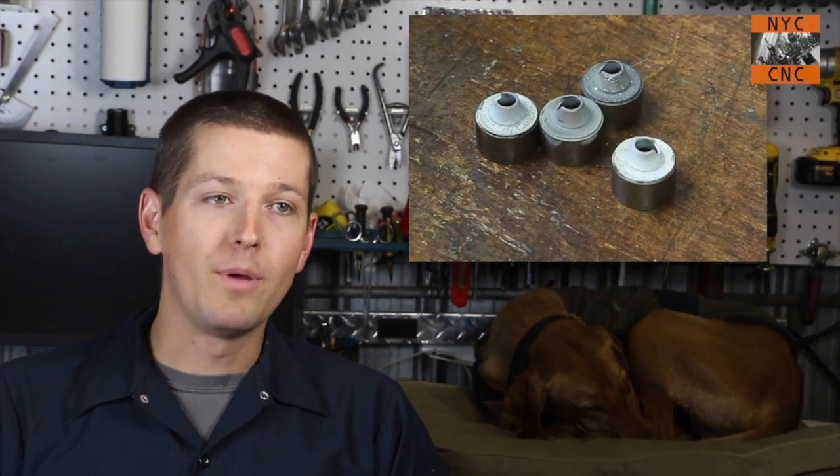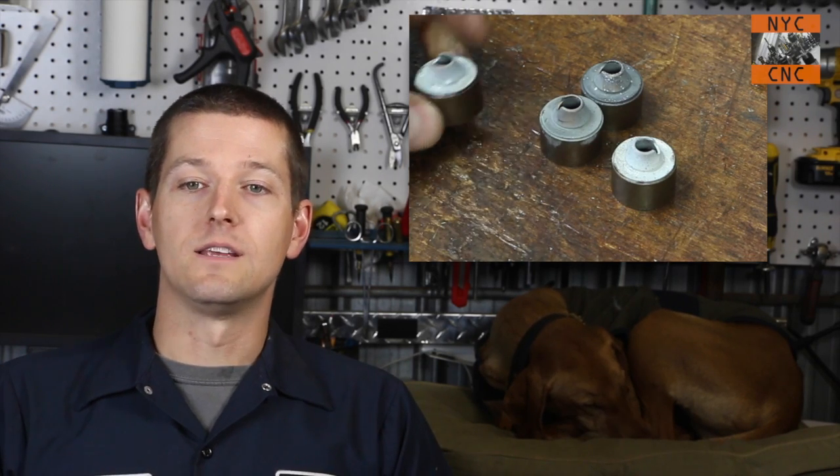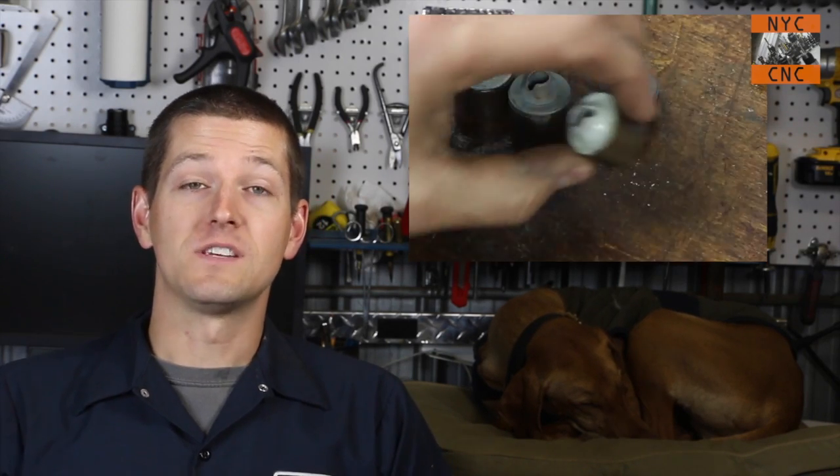The other thing we're going to do is a gun part — this is an epitome of a great example, and it's probably similar to something like a carburetor. This is a .22 — part of a .22 — it's super fouled up with lead, as you can see here. This is where the ultrasonic is great, because not only does it do a good job of cleaning, but you can drop a whole bunch in at once. You could clean this by hand with a toothbrush, Q-tips, and scrubbing in each end, but the ultrasonic cleaner doesn't care about complex geometries, complex surfaces, or hidden nooks. That's why I think this is a real win, given the price.